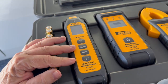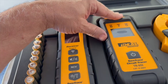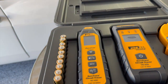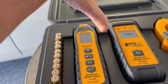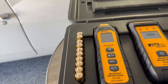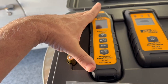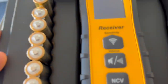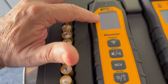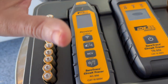This is how we find circuit breakers. You have the receiver; the transmitter you plug in to find any circuit in your house. It can find anything electrically — telephone cables, coaxials — so it emits a signal, and then with the receiver is where we find it. So we can do it on cable, one end of the cable. But for electricians, for circuit breakers, it'll give you the intensity of the tone, your volume, and it'll show you on this display here when you're at the desired breaker. That's what this does.